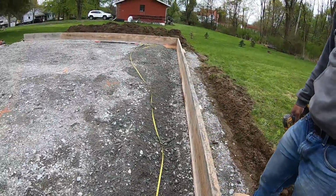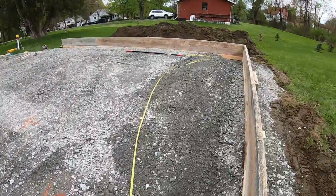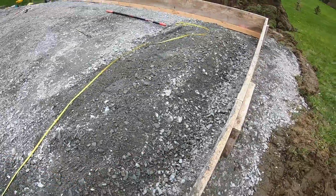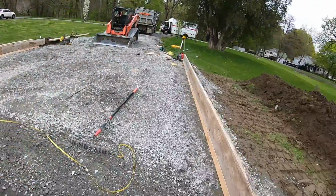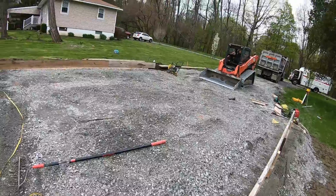I don't know if you can see with the view, but it's all tapered at a 45. And that's what you call a haunch. Then rebar, get 2 strands of rebar put in that with wire mesh wrapped into it, and wire mesh throughout the whole thing. Then it acts like a crab cage and holds it together.